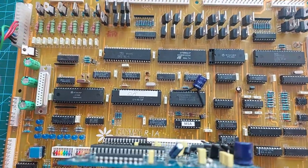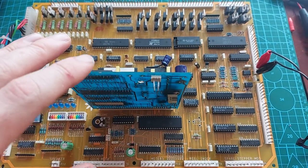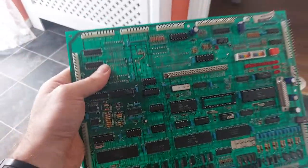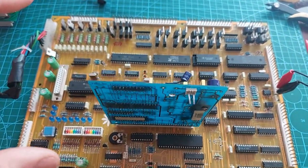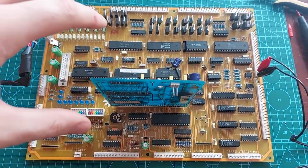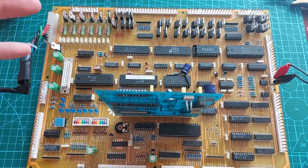The owner might notice some difference. I think what this is, is someone got fed up repairing battery-damaged boards, and they had one like this, stripped all the parts off it, photocopied the bare board, and then had a company make up a new piece. You can work out the trace design and send off to companies and they'll make a board for you. They won't just do one — they'll do runs of boards. It's not cheap, but it's not amazingly expensive either.